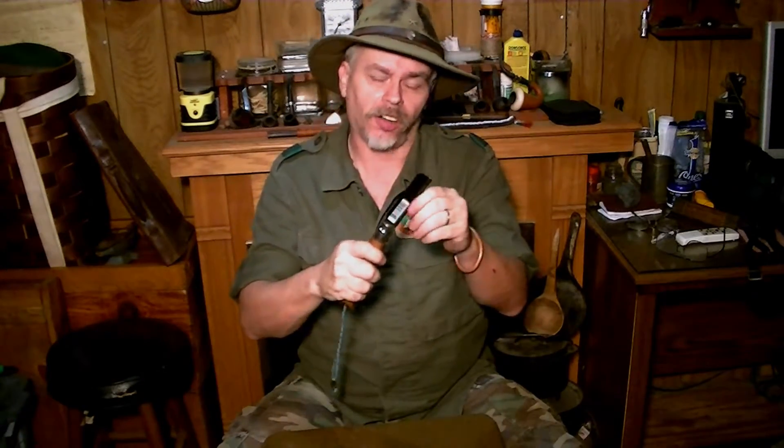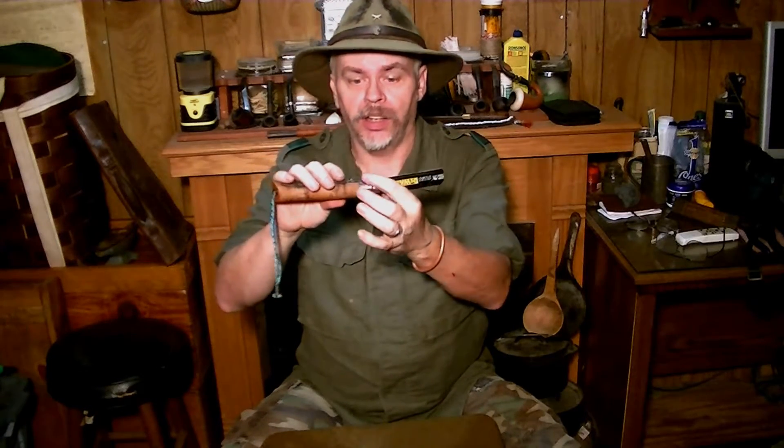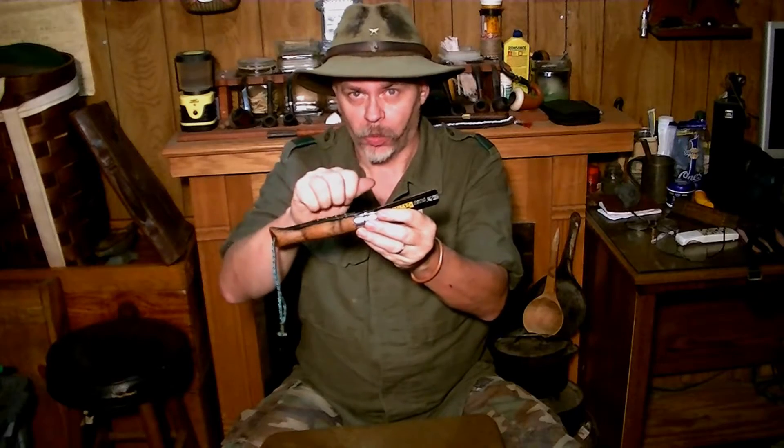So now I've got a saw that I can notch with, and et cetera, where I need a little fine cutting saw. And to be honest, I find that more useful than the big bulky saws. The modification you've got to make to that blade is, like I said, the back of it — you've got to notch it, and here at the front notch it, fit it to the locking collar, and then notch it in place with that or a file. That way it's rock solid. That was the problem I had in my first modification — I did everything by eye and I didn't fit enough. Lessons learned.